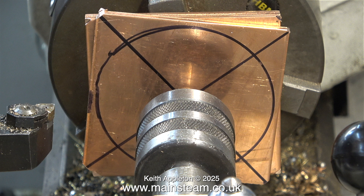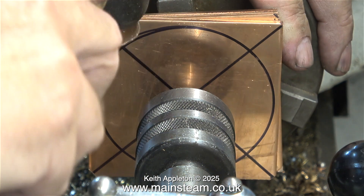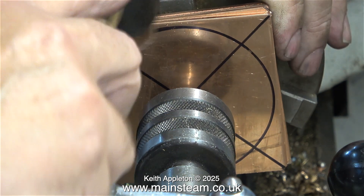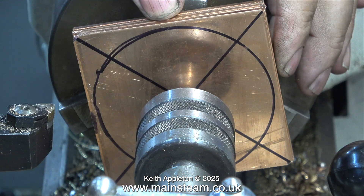Although, if I'm honest, it's down to me taking too deep a cut and rushing the job. I tapped the plates back into position using a soft hammer. I also thought this would tighten up the plates, which it did, until the bolt broke. The bolt was weak anyway - I should have known better.